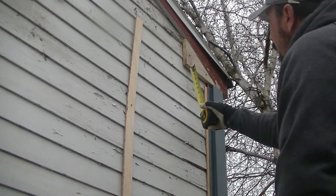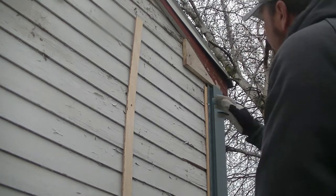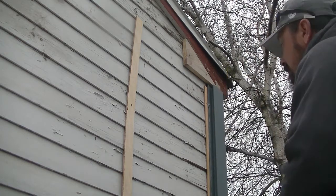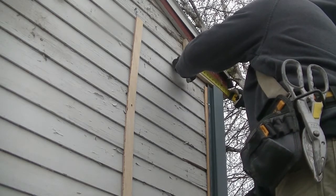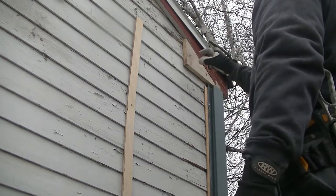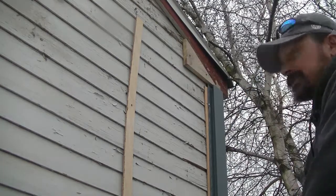I'm also going to add, though, a little bit. I'm going to add the 3/4 of an inch that's necessary to take the bottom. So if I measure 9 1/2 plus the 3/4, that puts me at 10 1/4 that I'm going to cut. Now that's just the width of the piece. The length of the piece is going to be 15 1/4 plus 3/4, which is 16 inches. So if I cut something at 16 by that 10 1/4, it'll be enough metal. And then I'll show you how to use the brake.